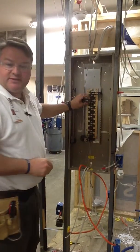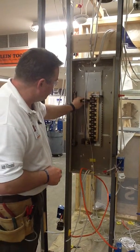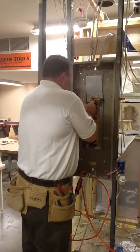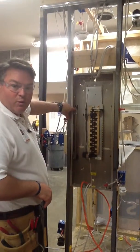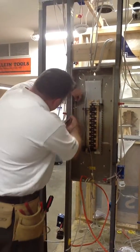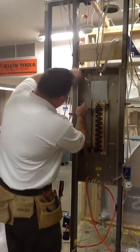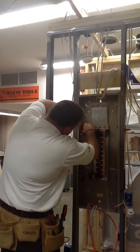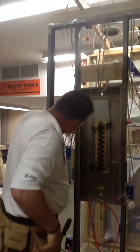Now let's say that I'm going to put this breaker in the 3rd position on the panel on the left side, this exterior circuit that I'm working on. So what I would want to do is make sure that I'm going to put the ground wire for the 3rd circuit under the 3rd screw. It's all about being organized. So I've got all this extra tail, and so I'm going to cut off all that extra tail. Now, nice and neat here through the bridle, and then at the 3rd screw, I'm going to bend that at 90 degrees. And I'm going to cut that tail off.